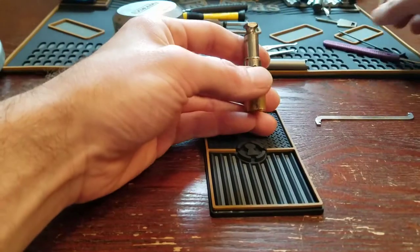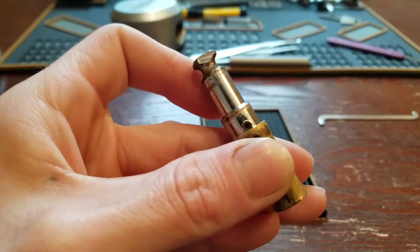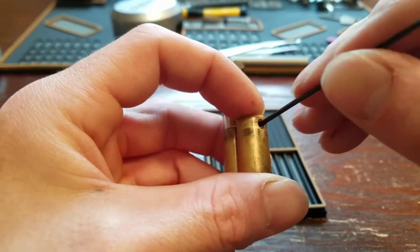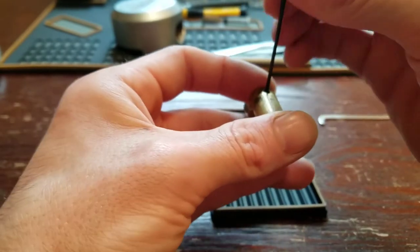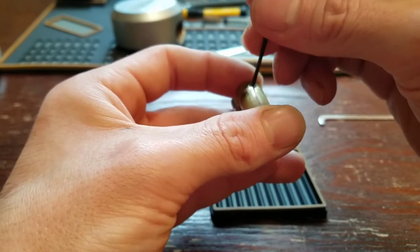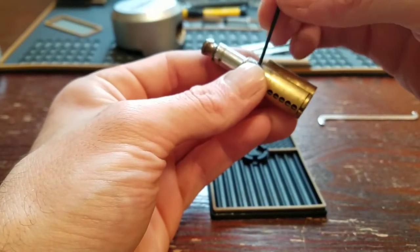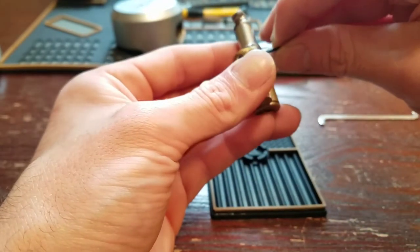This lock is a little bit different than the American lock as far as taking it apart. It did have a roll pin right here. I did the same thing with this and just put some grub screws in there. But it does have a screw down in here that limits how far the core can rotate. So I'm going to go ahead and get it backed out now, and we will lock it back up — try to turn those in instead of pulling them out.